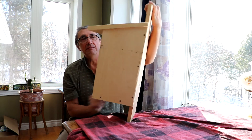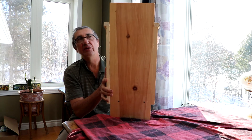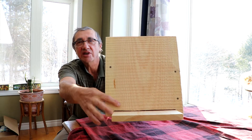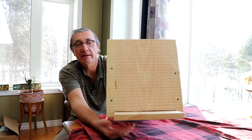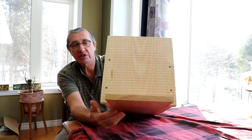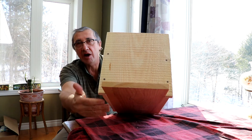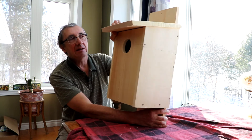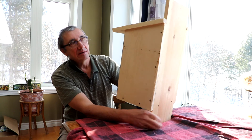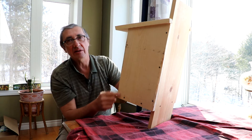The roof I've also made a few adjustments. Because I had the back extending up beyond the roof like the original plan, I cut the roof board with a couple of notches — I just cut a section out of the middle that would wrap around the back. Ideally, if I was planning to do this version originally, I would have just cut the back off at that level and had the top go beyond it a little bit. In this plan, the back board is 26 inches long. The sides are 17 inches tall at the back and 15 inches tall at the front.